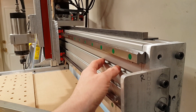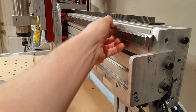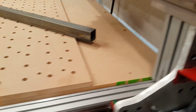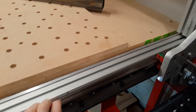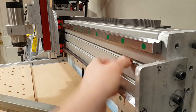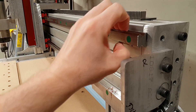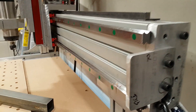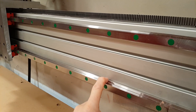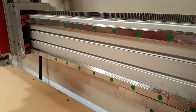Same deal with the beam here — this heavily borrows from CNC router parts design, with two linear motion bearings. These are probably the most expensive parts of the build. The 80-20 extrusion is sort of a fixed-price commodity, but finding these linear motion bearings cheaply is difficult. There are two standards: precision and ultra precision, and ultra precision gets very expensive, certainly at these lengths.